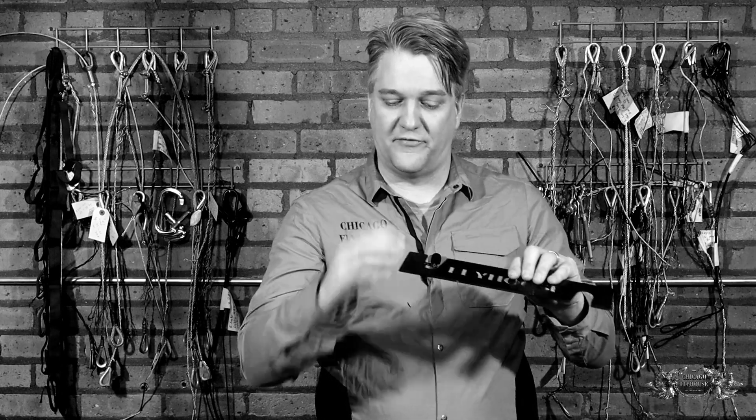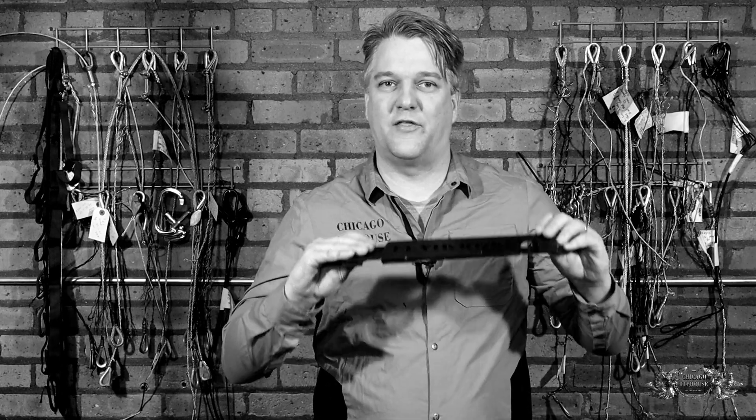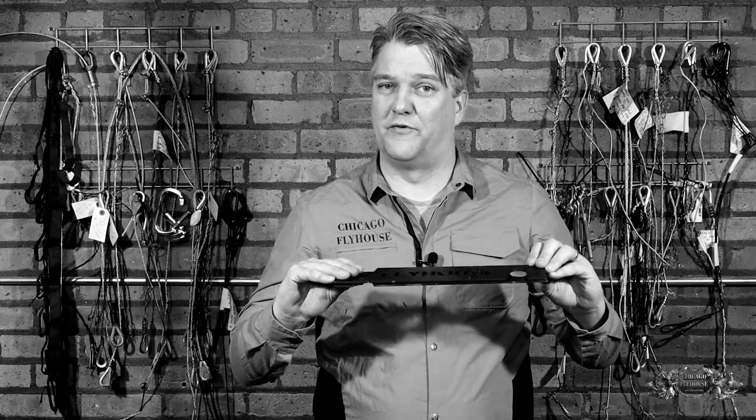So what's the takeaway from this video? We've learned that spreader plates are an important safety feature in our counterweight rigging systems, and that they help prevent a secondary crash in the event of a runaway. We want to make sure we install our spreader plates at the interval recommended by the manufacturer of your counterweight rigging system, and lock it down every time. If your arbors don't happen to have spreader plates on them, they can still be installed. Contact a rigging professional and you can have rigging plates installed similar to these. These notch around the verticals and then get riveted together so they become a permanent part of your arbor.